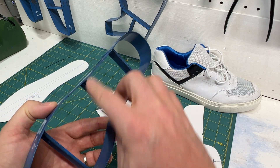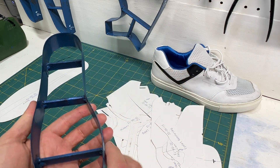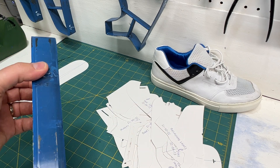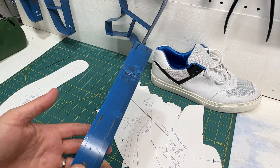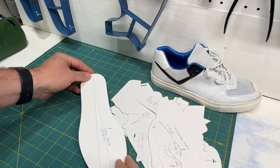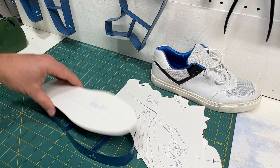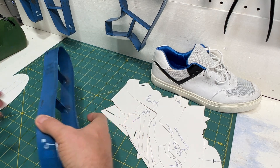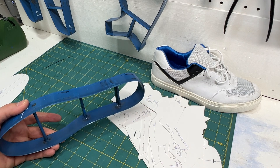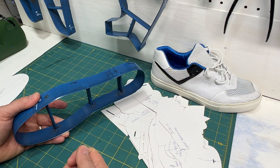They've bent it and welded it together. It doesn't look that clean, but they just have the metal bars across to hold it into the exact shape. Once they do those operations, they'll come back and bump it with a hammer to make sure it fits the paper pattern perfectly. Then they'll come back and powder coat or spray paint it. If they need to sharpen the edge, they will — periodically during the lifetime of a cutting die, they'll come back and sharpen it.